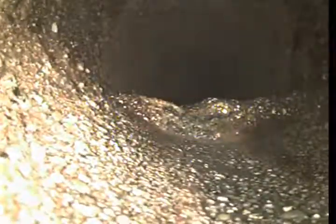and this section right here, the pipe changes from clay pipe to concrete pipe. This pipe is made up of concrete, and it's at the street going to the city. It's all the homeowner's responsibility until the city connection. That's what we call excess concrete. When they fused the pipe, some of it went through the inside during installation of this pipe.